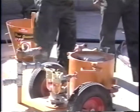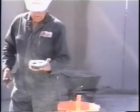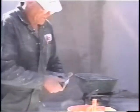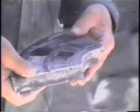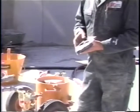The rubber pad is checked for wear, which shows that it was adjusted properly. It's worn more on the lead edge than it is on the remaining part of the rubber pad. And it's a very uniform wear pattern, the full width of the pocket, which shows that you had it adjusted properly. If you had deep gouges or tears in it, it would show that your rock shear was worn badly and allowed big chunks of the aggregate to get in and actually just chew it up.